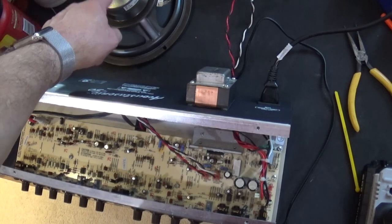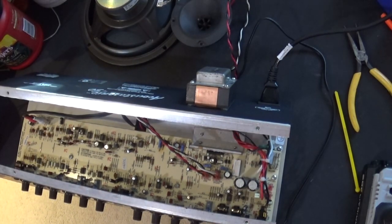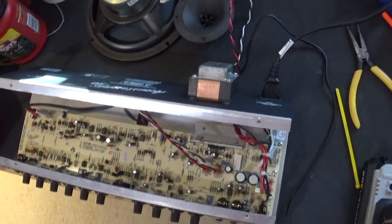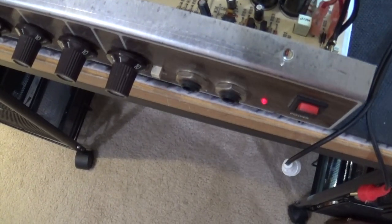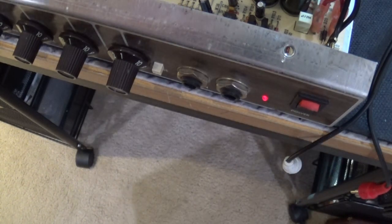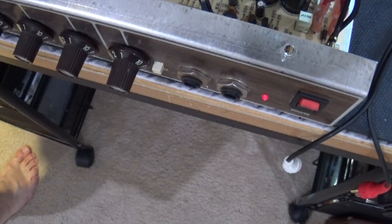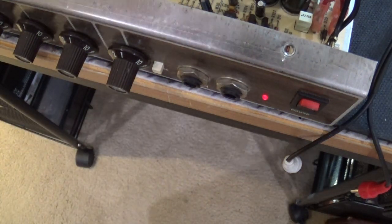So we've got the fuse replaced. I've got the speaker connected and I've got the tweeter connected here — because you never turn an amp on without a speaker. We're going to power it up and we're going to see what happens. Let's turn the power switch on. Oh, I just heard some noise. And if I bring the camera down here, you'll see that we have a power light. Good news. We're going to go up and see what kind of output signal we're getting. I'm just going to let this thing cook for just a couple of minutes.